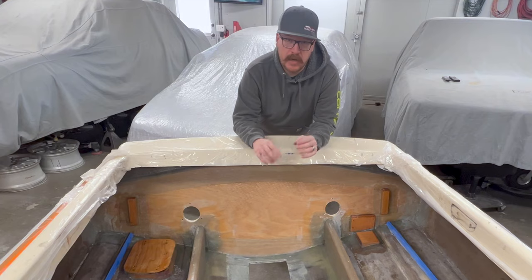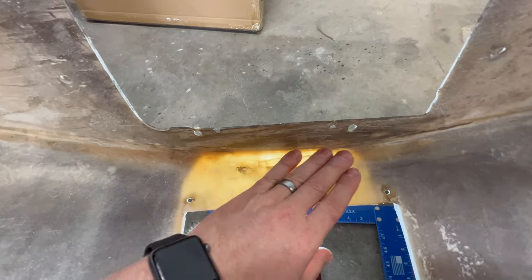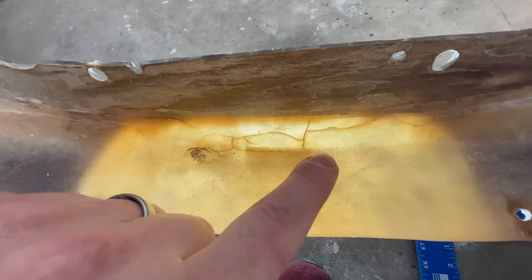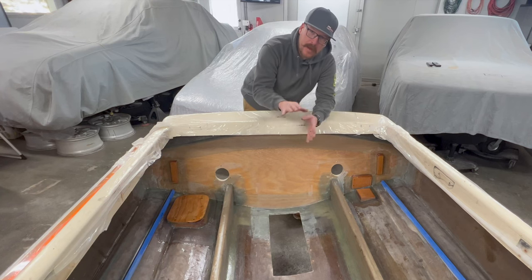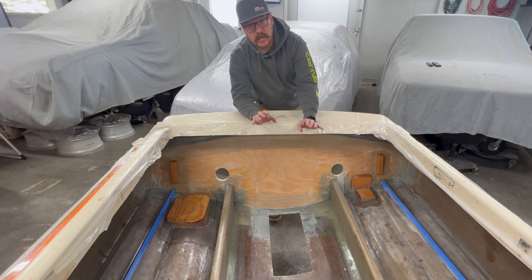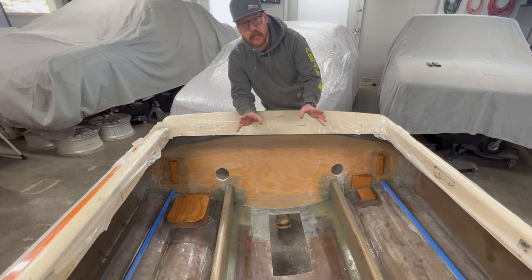Before we talk about that shoe and ride plate setup, I want to talk about the keel back here on the boat. If you go back to the second or third video I did show some concern — it was really thin, didn't appear to have any glass in it, just looked like resin, and you could see it was cracked. So I went ahead and built that area up with 1708 before I put the transom wood in, so all that fiberglass was built up underneath the wood, and then I cut the transom to fit.